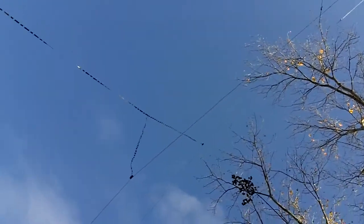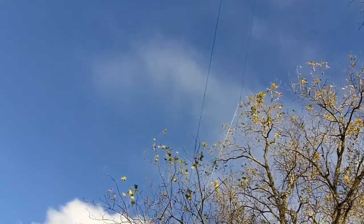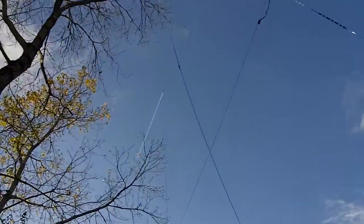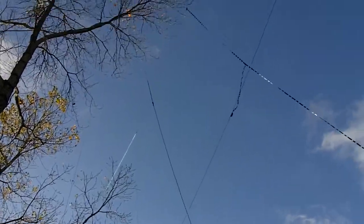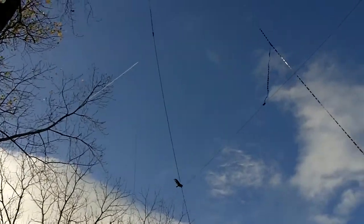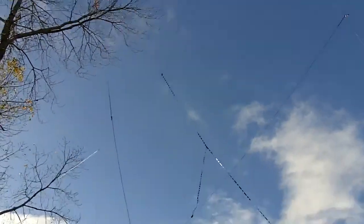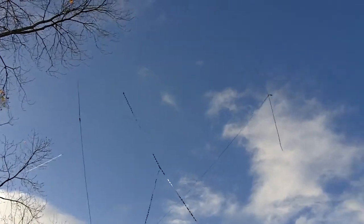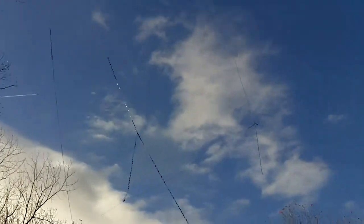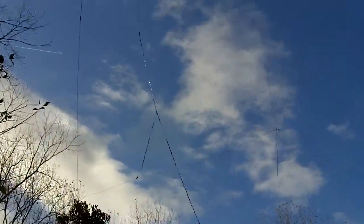The wire is so thin it doesn't really show up well on my little camera display, so pardon me if I point at sky instead of at the antenna. I'm really pleased with this antenna — I have two of them pointed in different directions. This one's pointed toward the Great Lakes states; I'm in South Carolina. The other one's pointed up towards Pennsylvania and the East Coast United States, and it also covers Western Europe. These antennas work really well, very quiet. When I compare it to a half-wave vertical for skip, it really rocks — makes a big difference, about 2 S-units over the dipole.